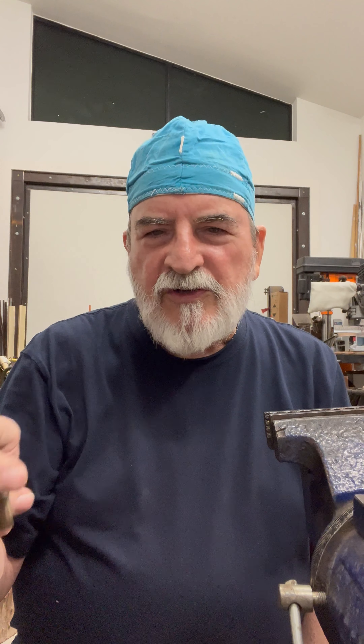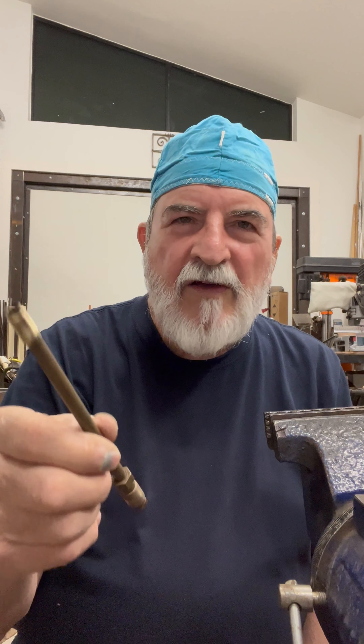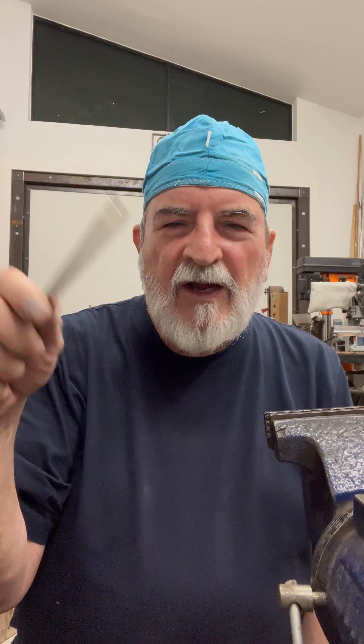There are also some other advantages with the Pro Master Kit — it's an extra $150. The Pro Master Kit has extra tips, including the number one and a half, which I use all the time, and a two and a half, which is the second-largest heating tip for welding thicker material. It also has some smaller tips for jewelry-type work or really tiny soldering work. The Cobra is the torch for that. It also includes these extensions, which I use all the time.